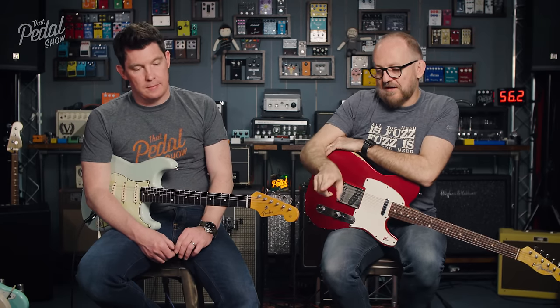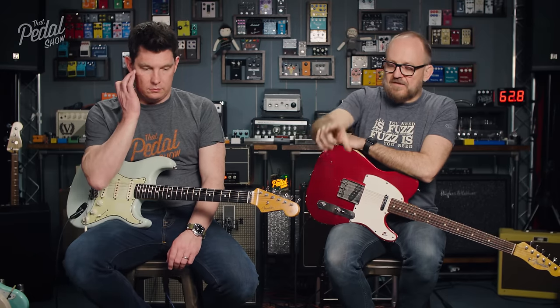But one really great thing: you get buffers that don't have any controls on them at all. They're just buffers, a one-to-one amplifier. Same level goes in, same level comes out, it just changes the impedance. But the great thing about a buffer that has a level control is it's basically a master volume for your board. If it's at the end. If you put it after your gain stages, then you are changing the level going into the effects.